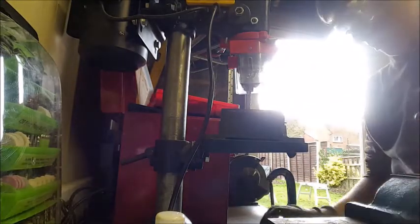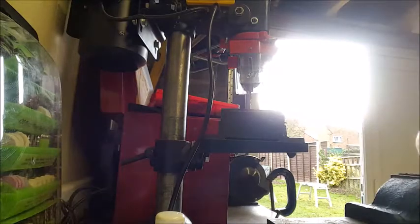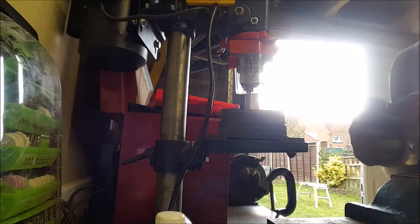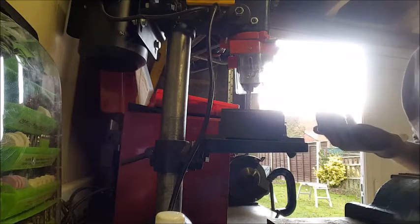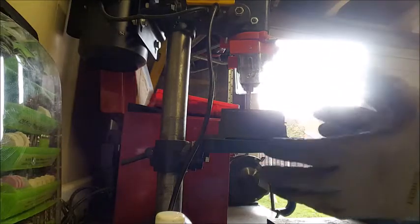Generally drilling a few holes. Chain drilling's really good because then you can just go round. Another thing you can do is get this thing called an abrafile, which is a hacksaw attachment. You drill one hole, you get an abrafile in there, and you can just file around as if you were sawing. But this is my preferred method because it involves one thing, and I don't have an abrafile.